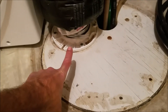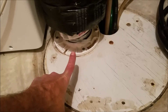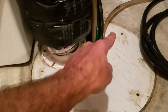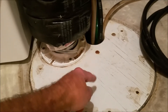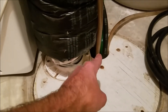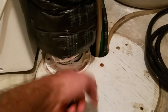Right here you've got an upside-down toilet flange — that's where I used to attach my system. Over there I've got another toilet flange on the bottom side with bolts, and then two pieces of pipe coming down making a J-trap. Items like the drain from the dehumidifier, the water softener, and the air conditioner all drain in here.